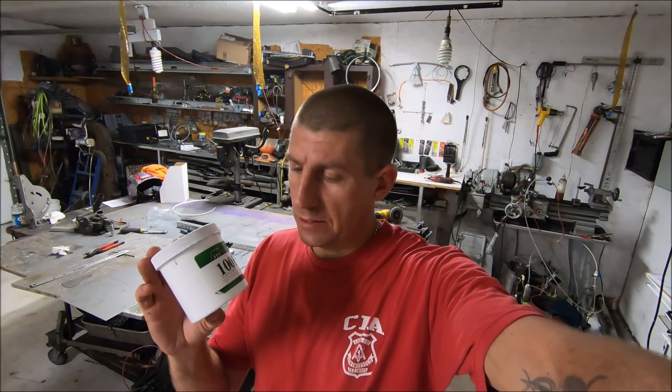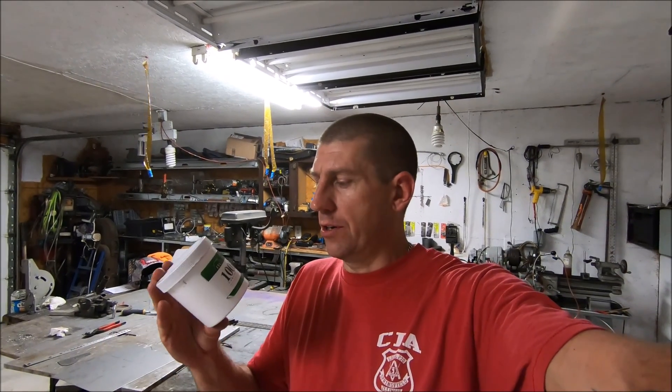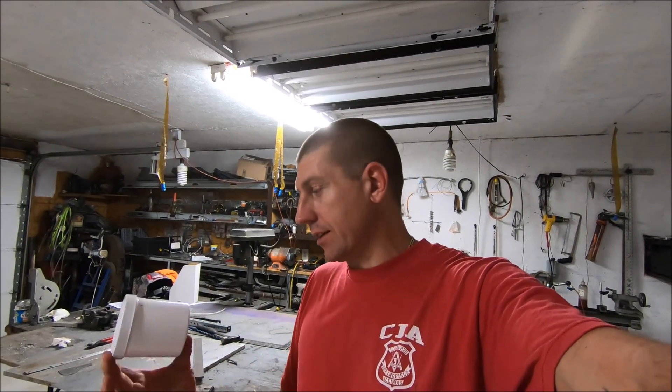So there you have it — this stuff definitely increased the temperature of that foundry. I didn't do anything extra special. Even earlier in the day when I was doing testing, turning up the gas and the air on the propane had little effect on temperature increase. Once you get to a certain point, you're just making a bigger fireball come out the top. Adding this stuff took us from right around 2,300 to 2,400 degrees. Your typical average was more like 2,100 to 2,200 degrees, so you could say we achieved a 200 degree temperature increase just by adding this stuff. I used the entire pint — this was $55 — and we'll leave a link in the description because it definitely gave us a little boost and we need all the help we can get where we're going.